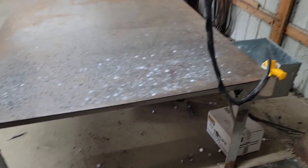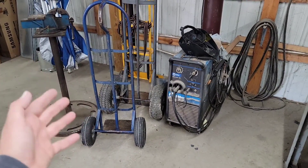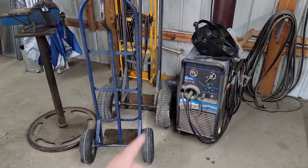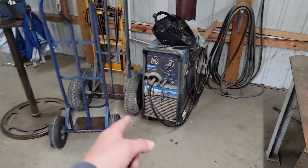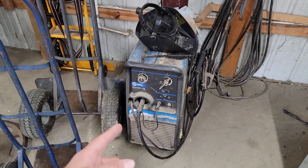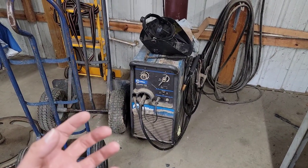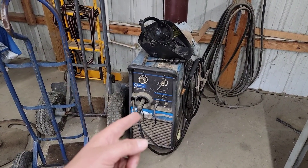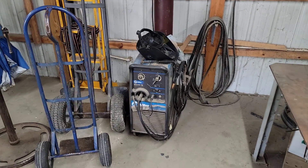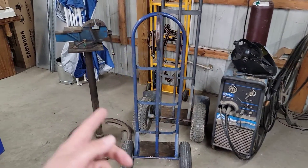You may need a table to do the work, and a dolly to transport equipment from your vehicle to the installation location — we've got Big Bertha and a smaller dolly. You may also need a MIG welding machine to weld gas line, since if gas line is inside a wall you can't have fittings — you have to weld them. We also use the MIG welder to weld brackets for equipment installs.